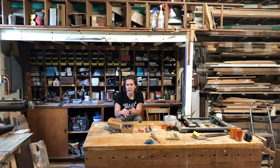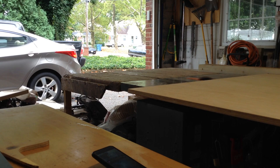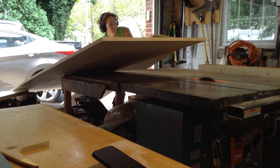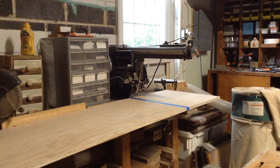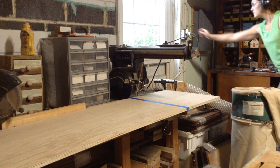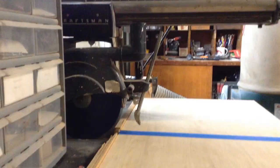The second video will cover making the doors and the base, all out of solid oak. The last video is the catch-all for finishing work. This project starts like most — breaking down sheet goods. I'm building this out of three-quarter-inch cabinet-grade oak veneer plywood. I chose oak because it's going to be stained; maple plywood doesn't take stain well, and the quality has gone down in recent years — it comes out blotchy.